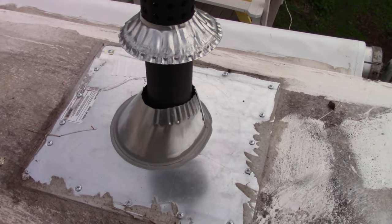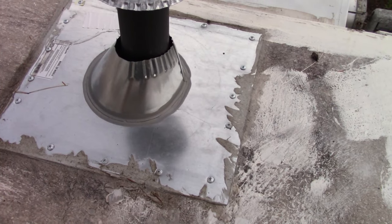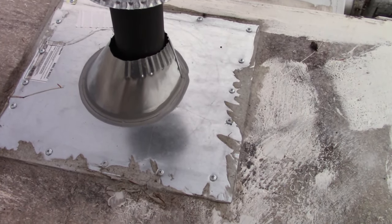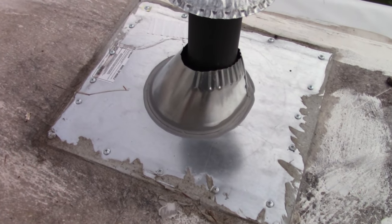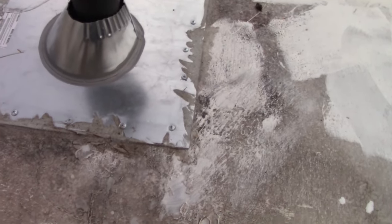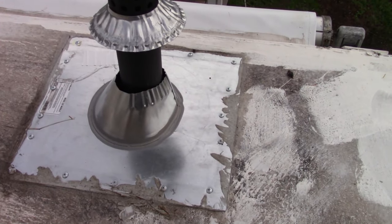Here's what it looks like with the storm collar in place — it's just a standard jack. It's been siliconed down and sheet metal screws run about every three or four inches, which has been plenty so far on a flat roof. So far so good.